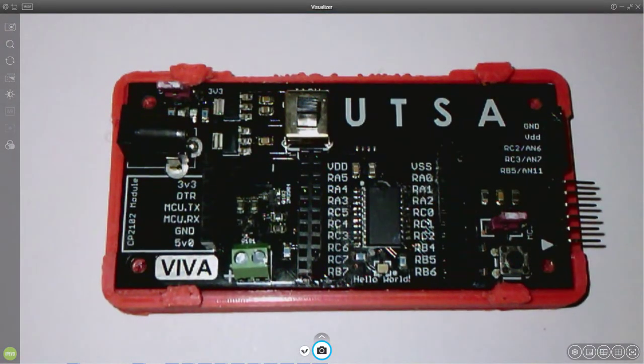So that's Simon Says. Now you can even spice this up a little bit, since you have to have a display. You can also use the display — you can keep score by sending the score to the desktop and show how many sequences you've gotten right and keep high scores and that sort of thing. You could even store the high scores in the EEPROM on the chip, which would actually be non-volatile. So even when you turned it off, you'd still have the high score saved. That would be plenty of modules for two, even maybe three people.